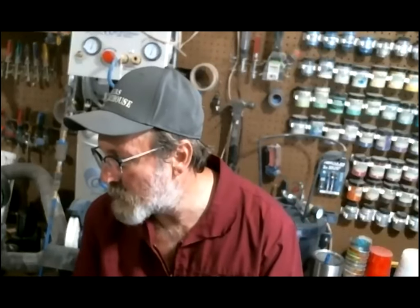The problem with these little pots is that they tell you they're rated to 60 pounds or rated to 80 pounds. Well, that's the guys putting a sticker on them. Nobody ever tests them, these Chinese pots, they just don't. And the only way you're going to know if you're getting a pot that is truly tested is if it has a metal stamp on it. And there's only a few companies like Binks and California Air Tools that actually go to that extreme. So know your pot and just push your resin to that.